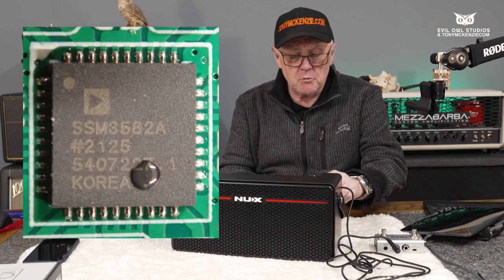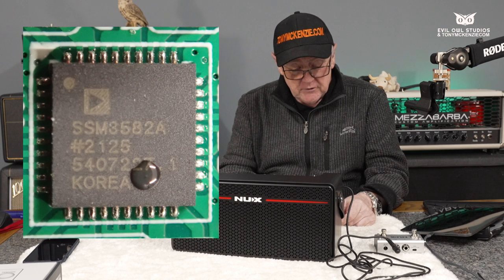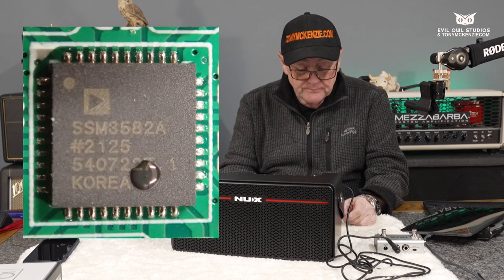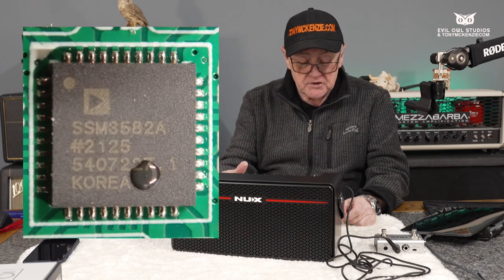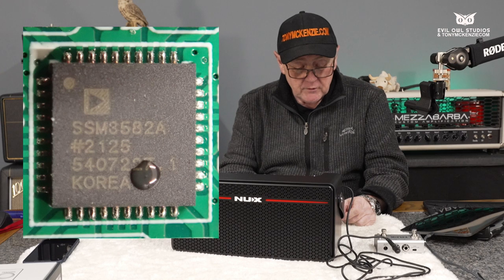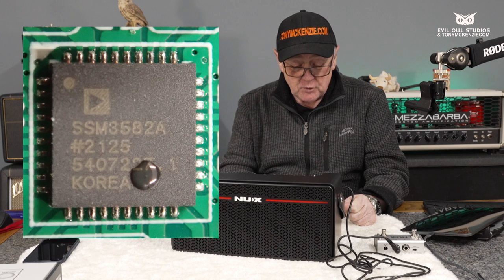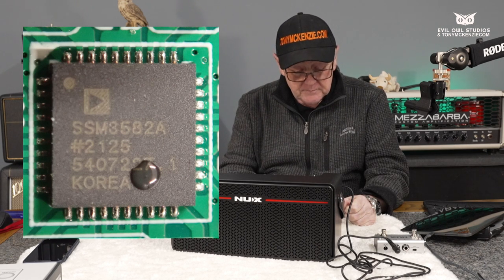And this supply here coming on the input side is 15 volts. But I doubt that really equates to the input of the particular bit. But it could do. You can have a mono mode also for increased maximum output power, and it can get to 1 times 49.69 watts output at 16 volt power supply to 2 ohm loads, believe it or not. So that's 50 watts. That's wild.